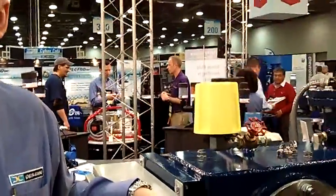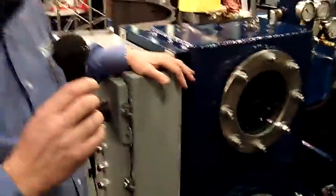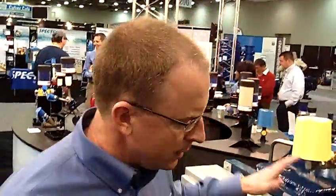This is an industrial vacuum dehydration machine. It is what we typically refer to as a medium vacuum machine, and its purpose is for removing water from industrial oils. Applications like turbine oil, lube oil in paper mills, oil in steel mills — most any application that has a high constant ingress of water, this unit is designed for pulling the water out of it.